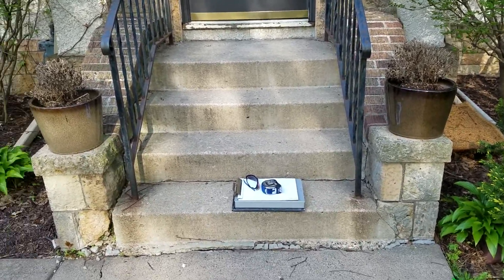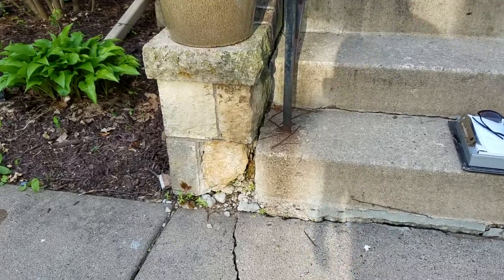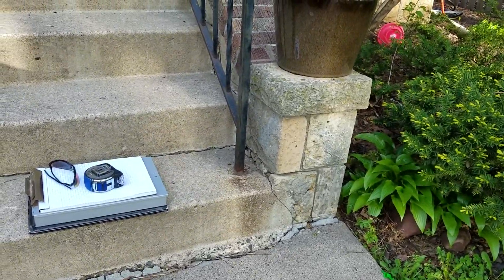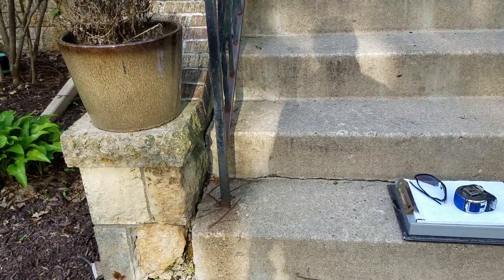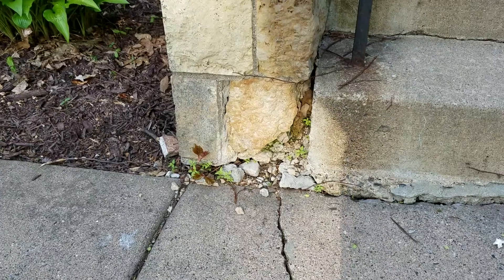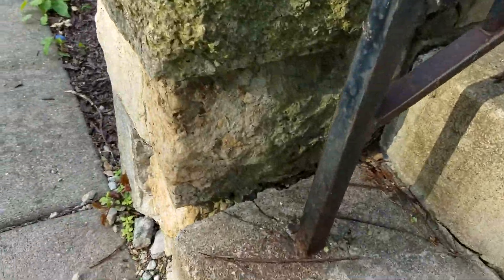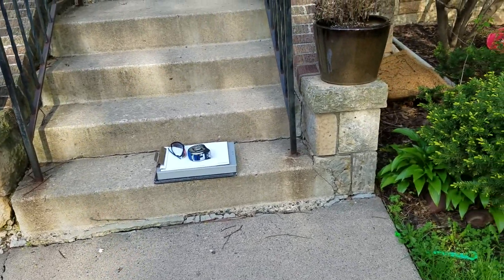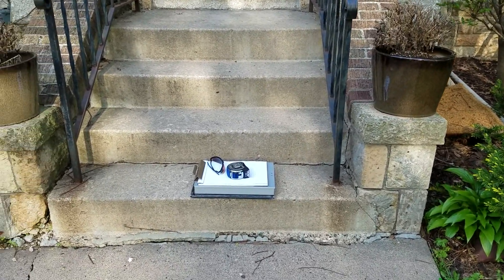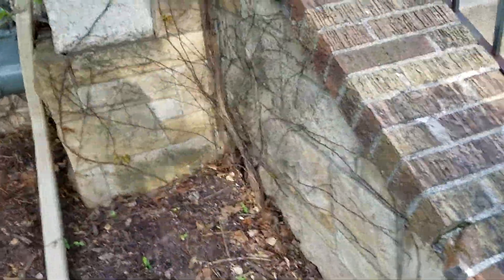The customer is looking to have some work done on their buttresses on the stone in the front. Both two front pieces need to be replaced — we're just going to take some thin veneer, chip away what we can to get thin veneer on these in this particular place. On the sides, the side joints here and here, we're going to clean them out and tuck point them. The size of those pieces is around eight by six, in that general range.